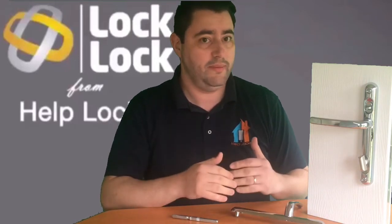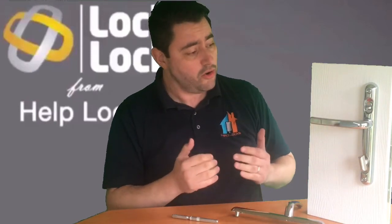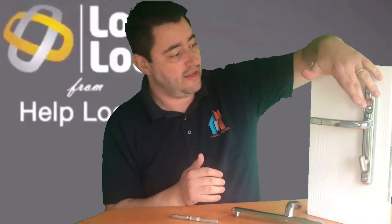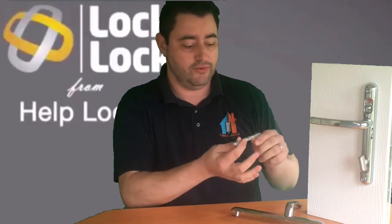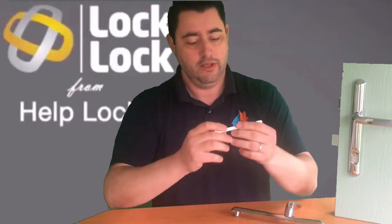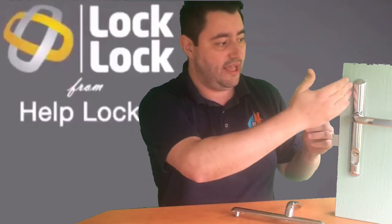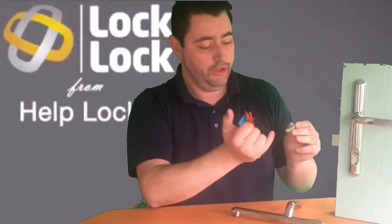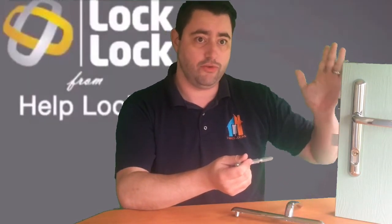That cannot be manipulated from the outside, and the reason for that is all the locking mechanism is built onto the inside of the internal part of the handle. When you pull this switch down it drops over the spindle inside the handle so that you can't pull the handle down. With a standard spindle — normally just a flat square — if you managed to take the outside of the handle off the door, you could push the spindle through or pull it out, and the handle on the inside would just drop off.